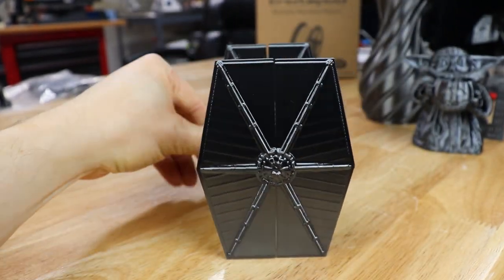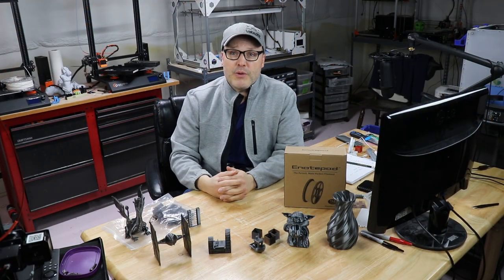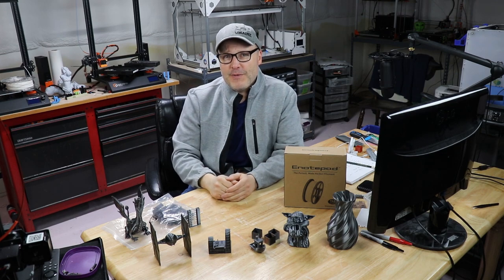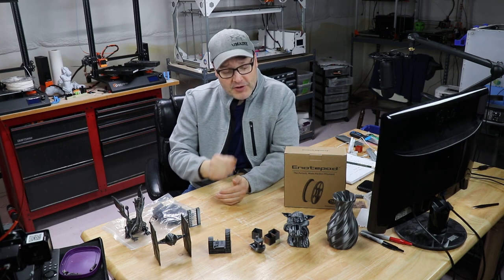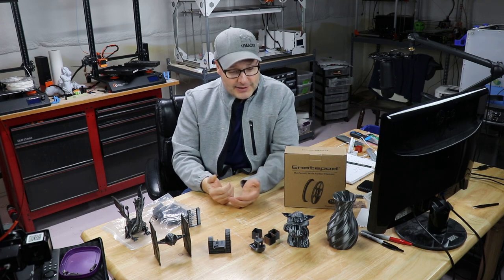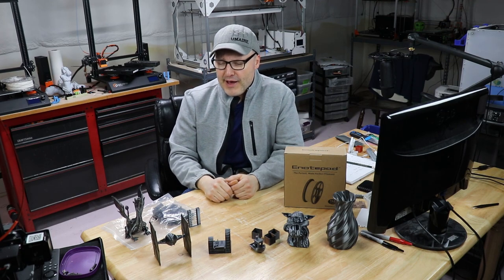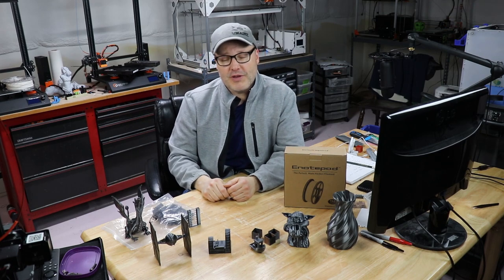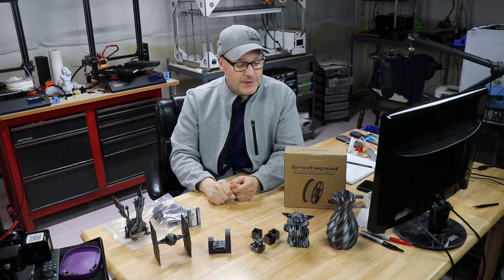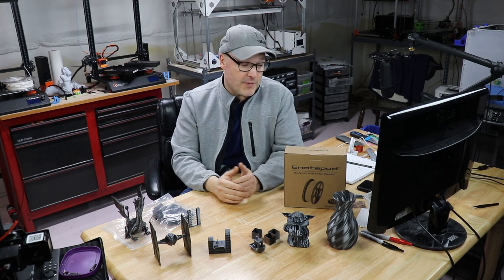I didn't invest a lot of time in my profile settings — once I had the flow rate and felt I had some good prints, I just kept hitting print. One thing with silk composite materials I've had trouble with in the past has been overhangs — sometimes they can get real loopy or be really difficult, especially with supports involved. But with this material, it was very easy to print with, so I feel comfortable giving it a thumbs up and recommending it. I love the color — it's almost like a gunmetal kind of color. They call it a black-gray, which I thought was interesting. Very rarely do you get a filament with two colors, but that's exactly how it printed. On the spool it has a grayish tint, and as you can see from the results, it looks really great and is very simple to print with.